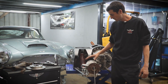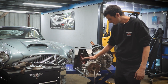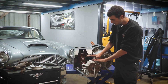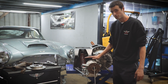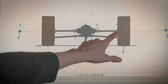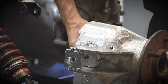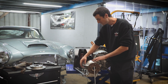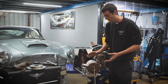I'm going to show you the other side of this working prototype to describe what we're doing to fit this under an E-type Jag. On the other side of this prototype we've got another upright, and you can see there's been a bit more work done to this one. The chassis leg on the E-type is right here — it's very close, and the bump stop mounts on the bottom of the chassis leg and contacts the top of this upright if you bottom out the suspension, so there's no room for a wishbone on top. In keeping with the E-type's suspension, the drive shaft would be here, and that is the upper wishbone — this hole here aligns perfectly with the universal joint on the drive shaft. So if we put a wishbone here from the side of the upright, the geometry would match exactly the E-type, with no need for additional CAD modelling.